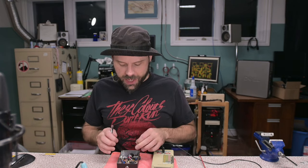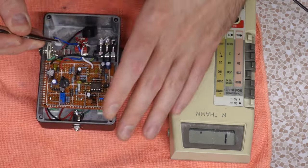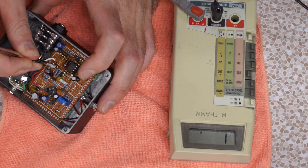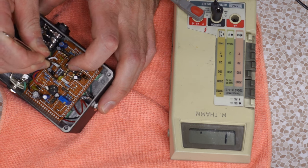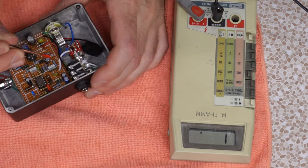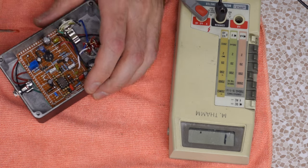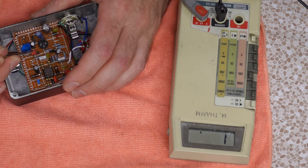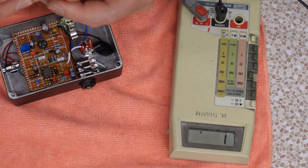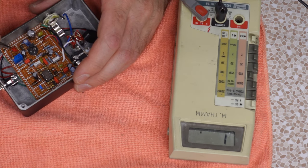Now, if there's one thing I've learned, that first input capacitor can make or break a circuit. So I've made it socketable. We put the input capacitor into place. Put the jumper to activate the stock mode. Put the jumper to connect the 560 to the stock capacitor. That's the feedback mode set. And this position will be stock mode also. I burned through a lot of jumpers in this build. Activate the diodes. And over here, the 10U 10K.